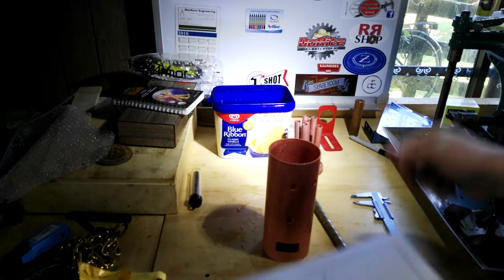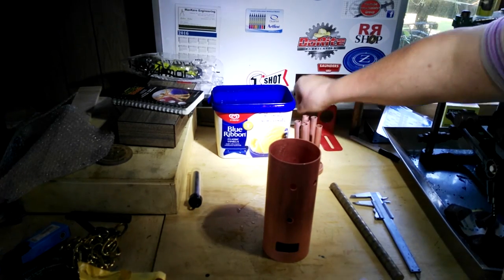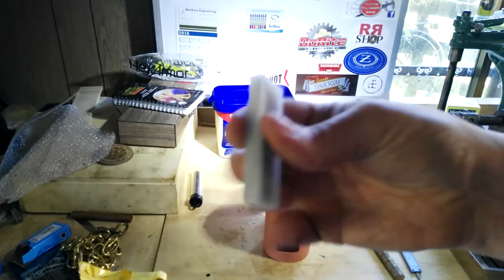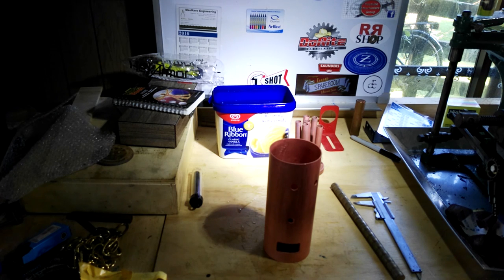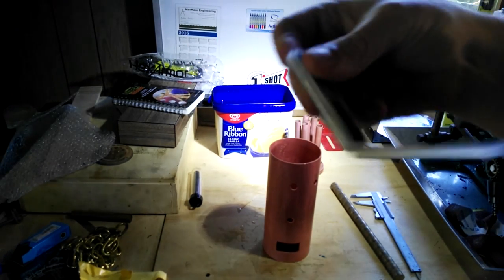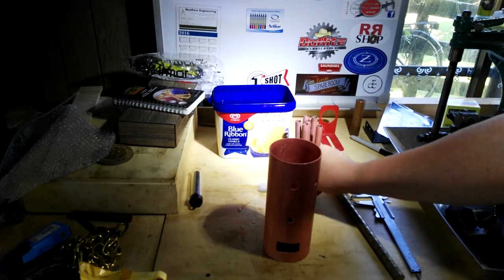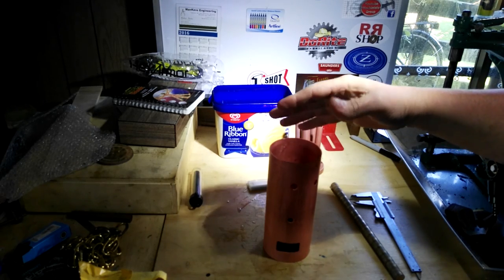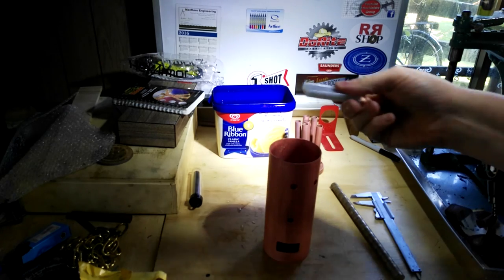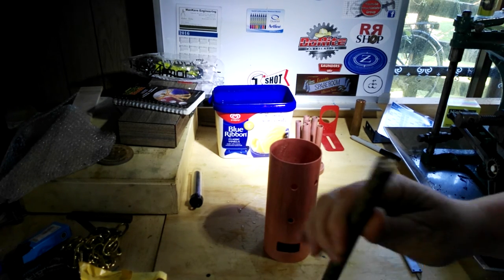It's nine point five - three eighths - to go in this hole, so we're going to make them to fit this hole and 14 mil diameter. It's tapped through model engineer thread which is 7/32 by 40. These are only carbon steel taps and I bought them out of England. Fairly useful little thread - very very fine, good for steam fittings. They come in odd sizes so you're not compromising the thread. The last boiler I built, the Kenneth Wells engine, I put metric through it but it was way too coarse and I wasn't happy, so we're going to use proper model engineer threads.